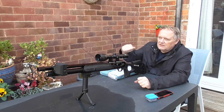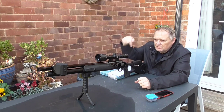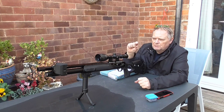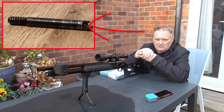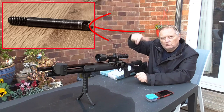Like I say, it's a snap-off cap, so what you need to do is drill down into it, get past the top. The way I managed to get into this in the end, I probably drilled down about a centimetre, and then using a hex wrench, I was able to knock it in and unwind it and get it out.